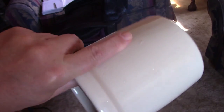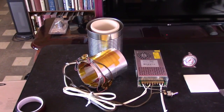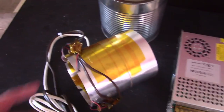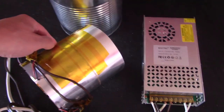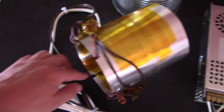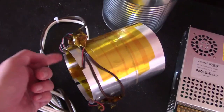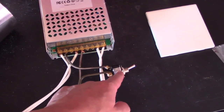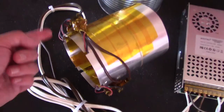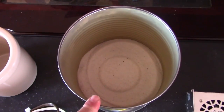The crock, by the way, stays in perfect shape — no problem at all. Super easy to put this together: just grab the aluminum flashing, wrap it around the stoneware crock to get the right size and tape it down. Then just tape in the elements there, tape the wires down and add some notches for the wires. Then I just wired it up — six elements, three to each wire. And then a switch to shut a set of them off so we could do three for low and six for high. Other than that, it's just a stoneware crock and the coffee can with one and three quarter inches of sand in the bottom.